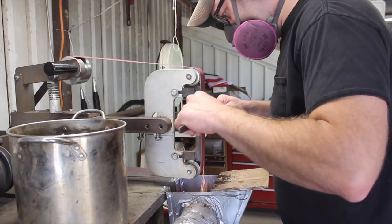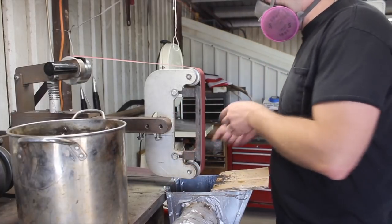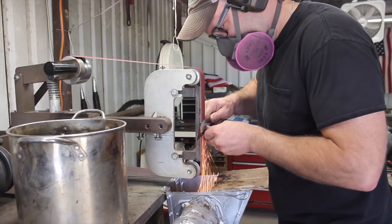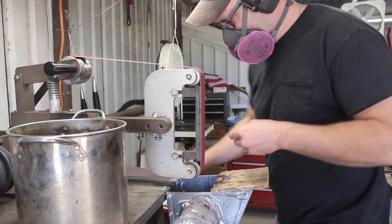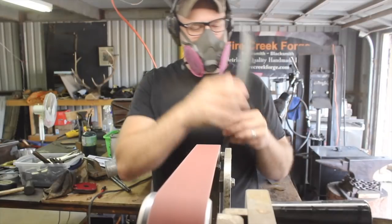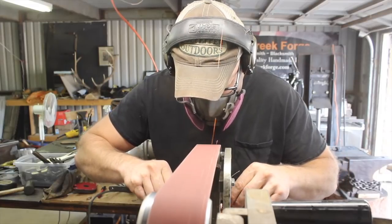You really have to be careful, especially when the steel is not giving you as much resistance, keeping everything flat and true. I think it's actually about time that I replace the glass on my flat platen right there — it's got some rather un-flat characteristics to it, so it's time to do that probably, but just taking my time here.